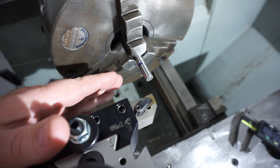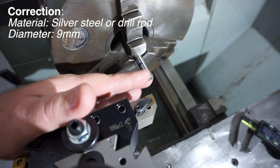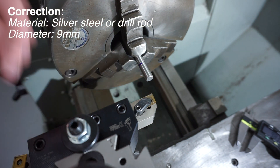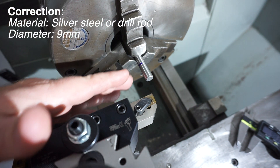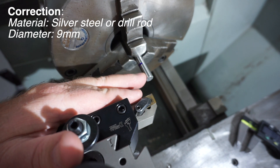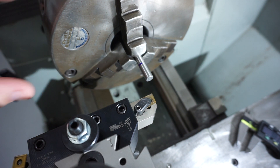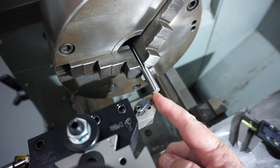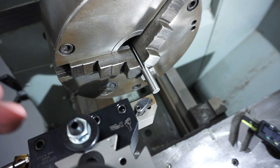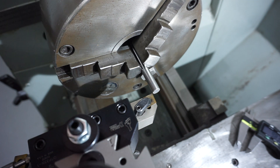So I'm going to start work on Doug's Bearing Edge Finder. Now, this silver steel he's provided — or bright mild, whatever it is — it's an imperial size and I've only got metric collets. It's 9.8mm, so I'm going to machine this down to 9.5mm, and that will fit my collet when I put it back into the lathe in the collet chuck to do the other side machining. The first thing I'm going to do is face this side, and I've got a dial gauge set up on the back so I can get an accurate measurement as I machine down the diameter.